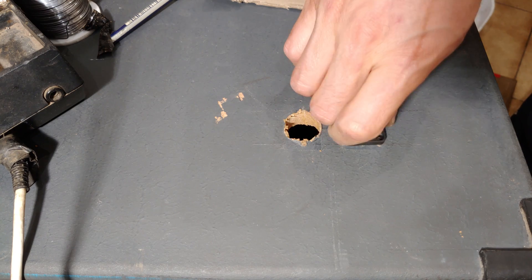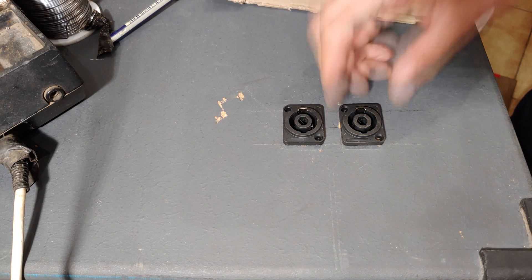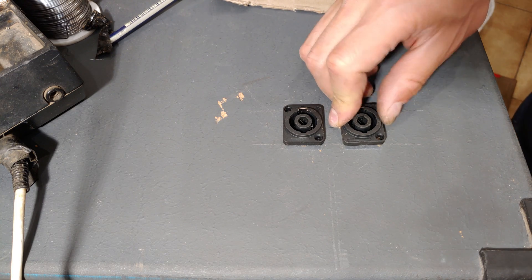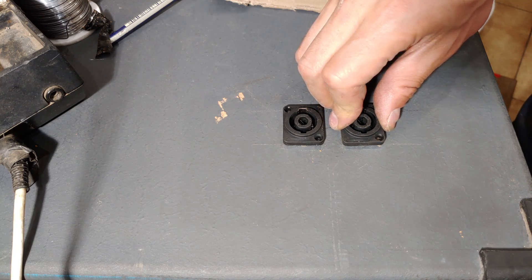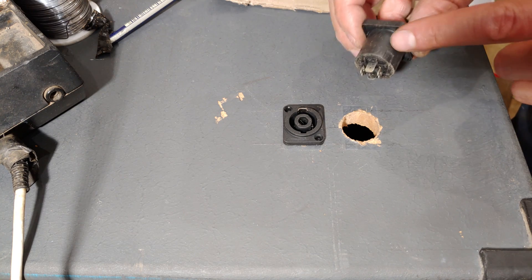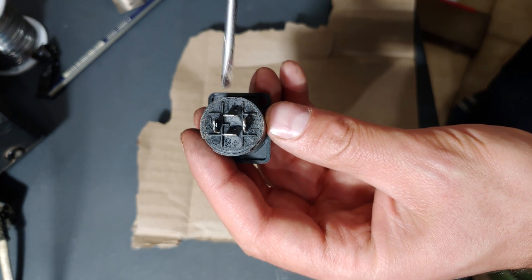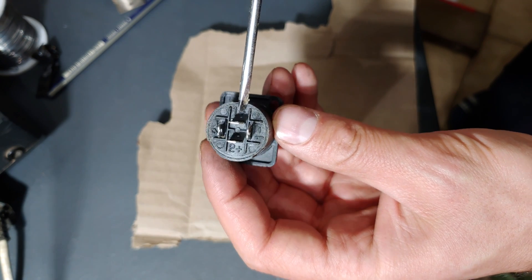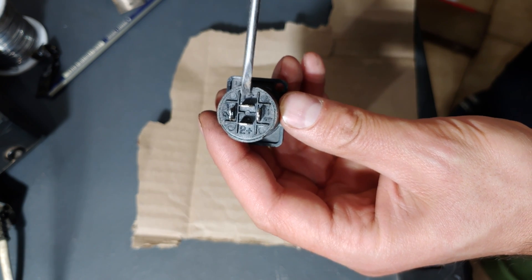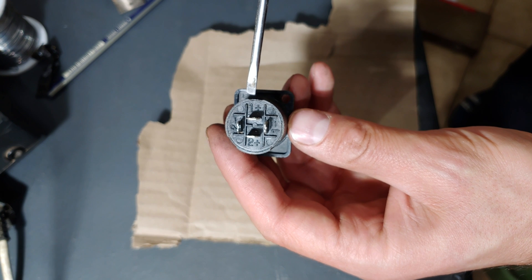There's the one hole and here's the other. Now all that has to happen is you solder the wires to the various pins and screw it in. Note that air can come through here, so if you want — especially in an unported sealed box — you could put a little silicone around there when you seat the connector. If you look closely you can see it says 1-plus and 1-minus: positive going to the positive of the woofer, negative to negative. If you're wiring with a DVC dual voice coil you can make use of 2-minus and 2-plus. In this case I'm using a single voice coil.